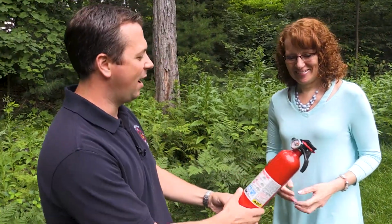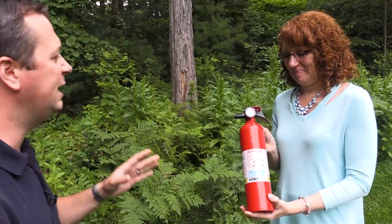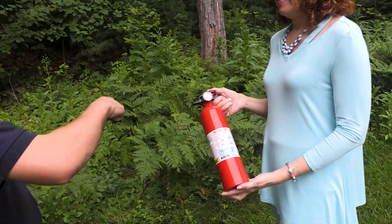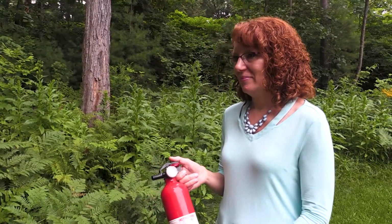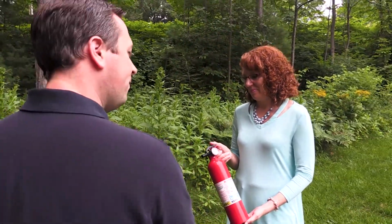Colleen, have you ever used a portable fire extinguisher before? No. All right, are you willing to try? Sure. All right, so we have a portable fire extinguisher. I'm going to teach you the PASS acronym, which is pull the pin, aim at the base of the fire, not where the flames or the smoke are. You want to aim at the base of the fire where the chemical reaction is taking place. You're going to squeeze the handle and sweep from side to side.